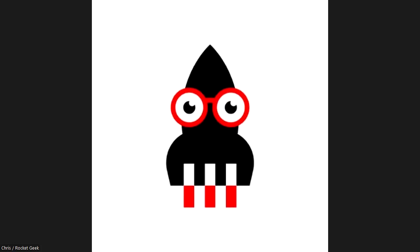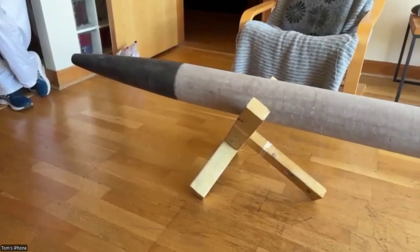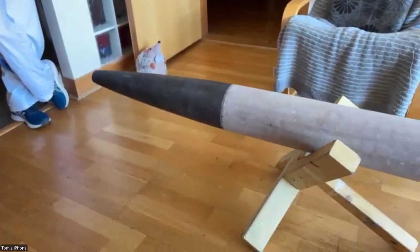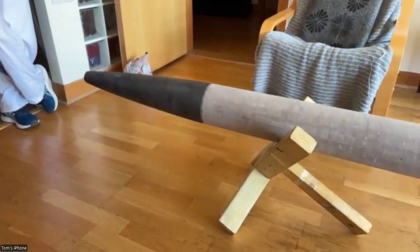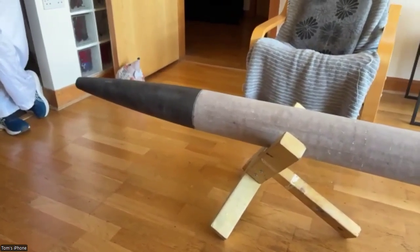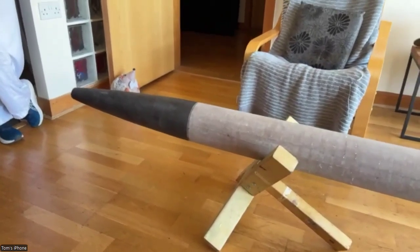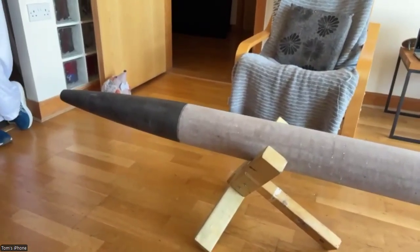Okay, so go ahead, press on. I guess start off by saying we're still waiting on two components being machined, so you can see we've not got a nose cone tip over there. But that's going to be ready on Wednesday. We don't have the M8 rod that runs through, because usually we compress it with an M8 rod running through to the bottom bulkhead. We also don't have the retaining ring for our avionics bay, but they're both going to be made this week, and they're documented in our tech report. So you're having those machined by someone else? Yeah, we're getting them machined by our university, but they'll be ready this week. There's just a little delay on some of them.